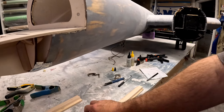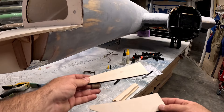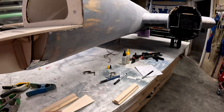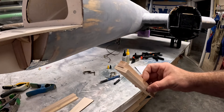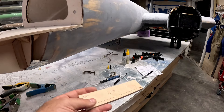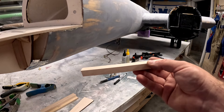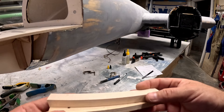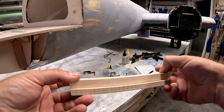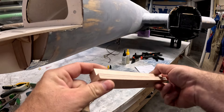Like I showed you before, I've got these upper and lower doublers for the nose gear structure. The upper one I'm going to get epoxied in, and then these are the actual nose gear mount rails. In the last video I had just this plywood piece here, and what I've elected to do is take a piece of — I believe it's half inch by three quarter or half inch by one inch oak or maple — I think it's maple — and then double this rail up just to give it a little bit more strength like we see here.